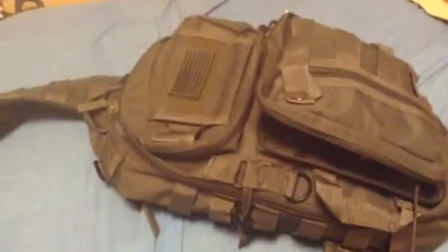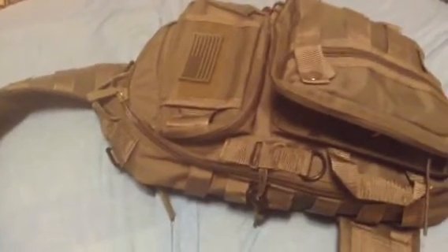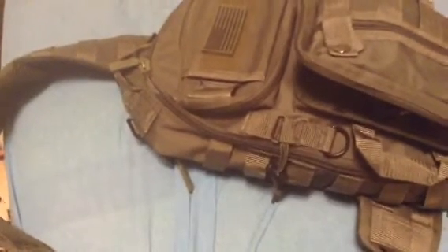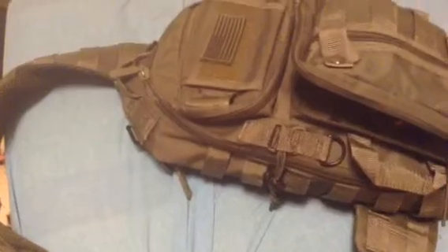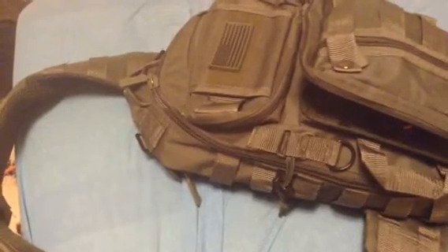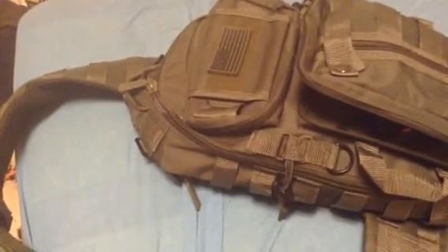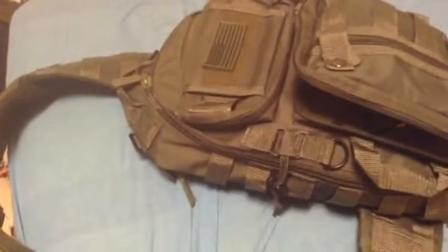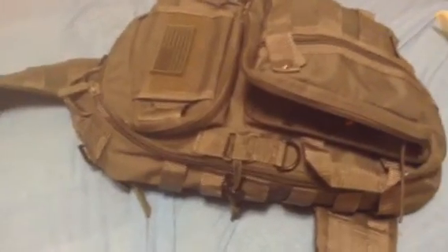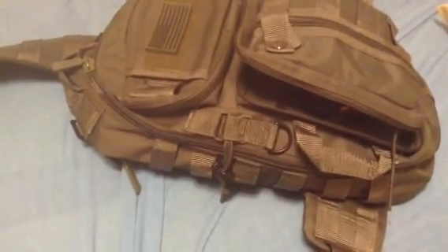I've done a fair amount of field antenna work in the military — between the PRC-77 and SINCGARS, I'd have to break out the book to remember how long to cut the wire pieces for the dipole or J-pole and string it up in a tree. I understand that concept. But what I'm looking for is a decent amount of transmit power in a man pack where you're hiking, moving, or riding a bike — you take the pack off, turn the radio on, start talking, and need to cover some distance, skip over mountaintops, without depending on a repeater. That's the concept we're trying to build.